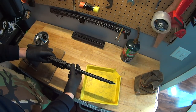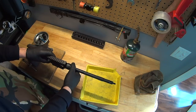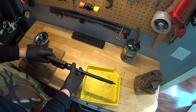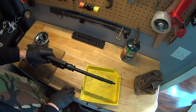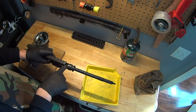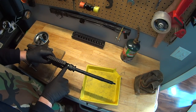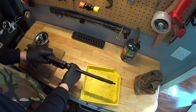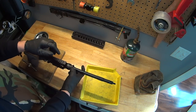And when you're screwing this on, guys, make sure that the barrel manufacturer that you're working with has produced a barrel that has been properly made, because one time and one time only, I was working with, I can't remember who the barrel manufacturer was. It wasn't Ballistic, but the alignment key, the tab, whatever this thing is called, was slightly proud of the threads. And as the barrel nut tried to go in, I kept hearing crunch, crunch, crunch, and I stopped and realized that I needed to file that down.